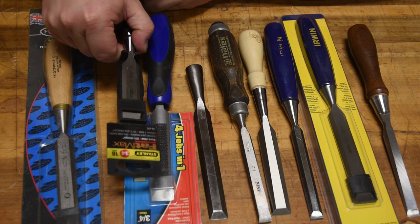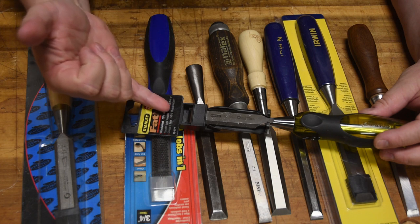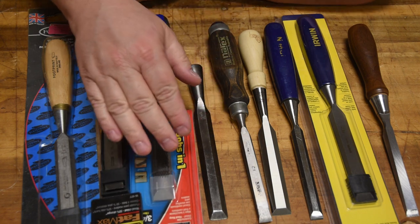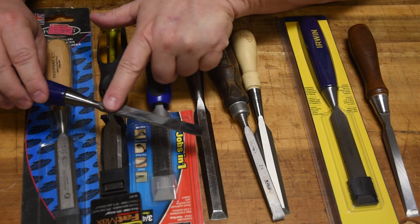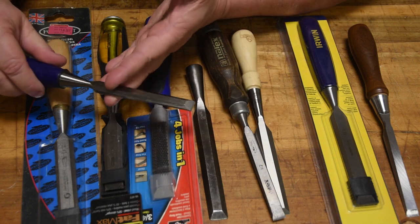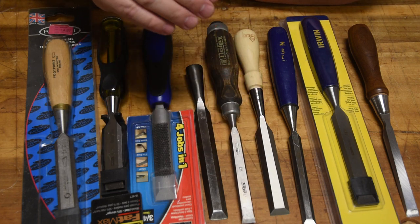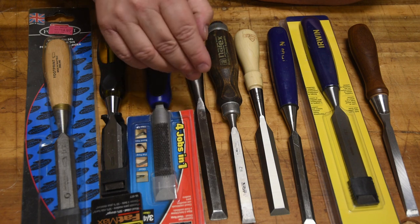That affects whether a chisel is so hard it holds its edge for a long time but is really hard to sharpen. Some manufacturers use that as a marketing pitch — here's a fairly common brand that says it's 50% harder and 50% more resistant to dulling. That just tells me it takes 50% more time and effort to sharpen it. Sharpening is incredibly important — if it takes you more than 30 seconds to touch up your chisel after initial tuning, more than likely you took a TikTok break in the middle of it.